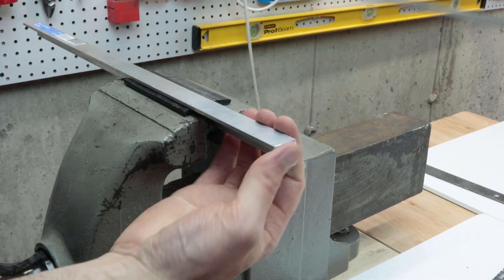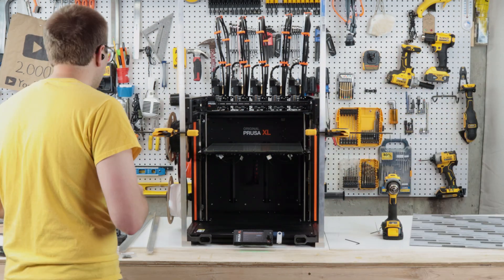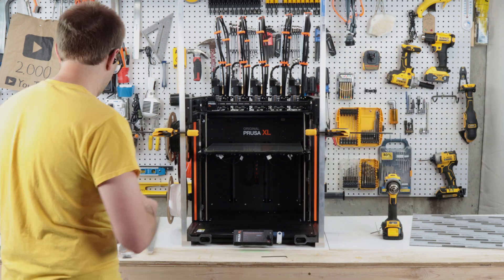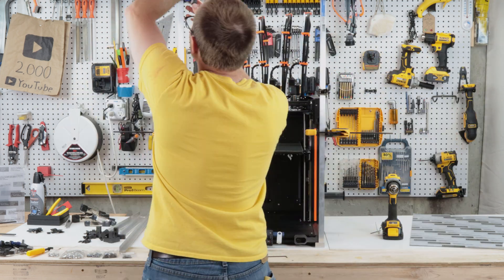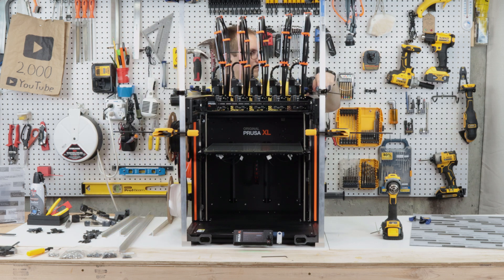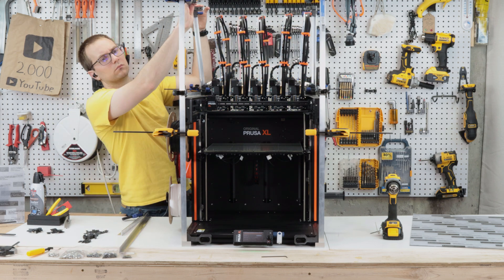After the miter saw I still cleaned up all the cuts with a hand file. I continued the build by bolting the 3D printed parts to the frame of the Prusa XL and attaching the vertical angle aluminum. At this point I was just attaching everything with clamps — I hadn't drilled holes in the angle aluminum yet. I was placing the angle aluminum in position, clamping it, measuring, and making sure I had good fits, working around the enclosure cutting and clamping piece by piece.